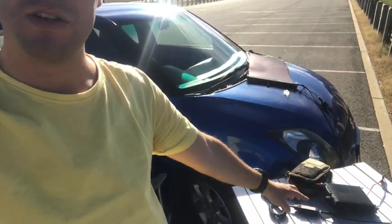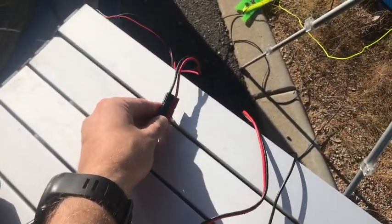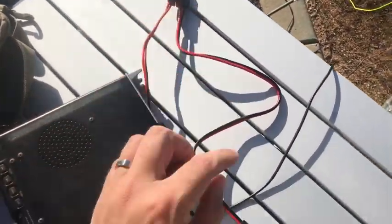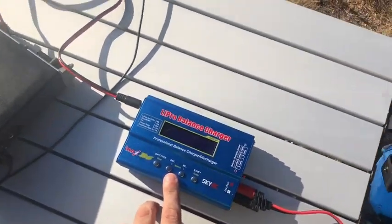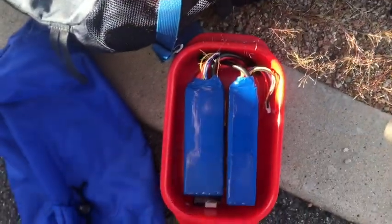I've been working for about an hour now — actually a little bit more than an hour. The solar has been holding up well; there's virtually no indication it's gone down, maybe one bar or so. This is sort of the station setup — you can see the solar on the car, and it's directly connected to the 817. So here's my LiPo charger. Because I've standardised all my connections to Andersen connectors, I can actually unplug from the solar and plug straight into the LiFePO4 charger, which delivers a balanced charge into my standard SOTA batteries.